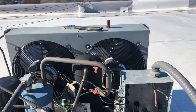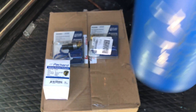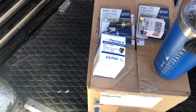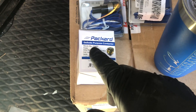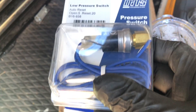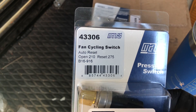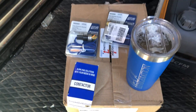Looked like a bunch of spaghetti in there, but it's going to tidy up pretty good. I'm going to use — let me get that cup of coffee going — that's a good cup of coffee right there. I got the 2-pole 40-amp, 240-volt coil contactor — that's what I always use. For the low pressure switch, I'm using the Mars 43341 — low pressure, opens at 5, makes at 20. And then for the fan cycling I'm using the Mars 43306 — it's going to make at 275 and open back up at 210. And that's how we're going to do that.